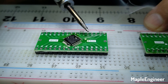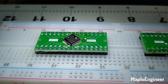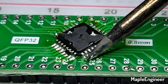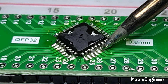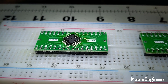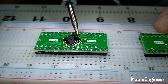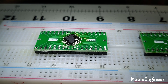Most of those are okay — I got that solder bridge out. Clean my iron, go back in there with a bit of flux and see if I can pull that out with the iron. It's just the first couple of pins that really want to create solder bridges. It's soldered but I've got these solder bridges causing me problems. Let's go in with a bit of flux, clean iron — come in and see if I can pull that solder bridge out. Nope, it is not going to come out. I'm going to grab a bit of braid.